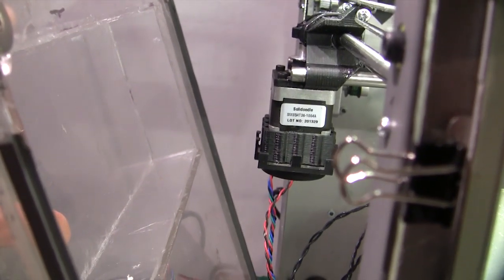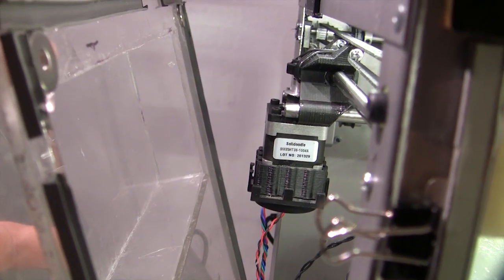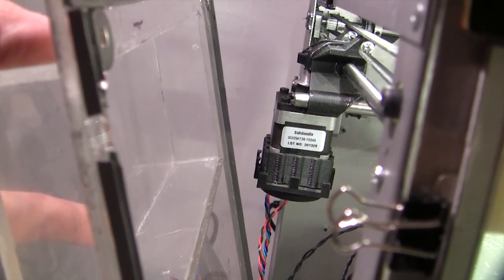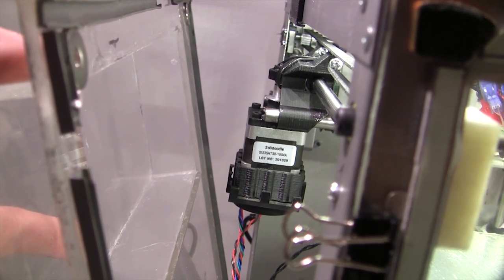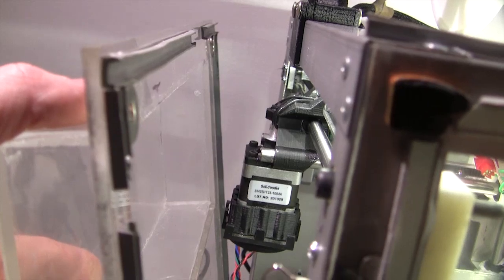And the blob on the bottom is a little fan thing to keep the stepper motor cold, again with a 40mm fan. I have had problems with it rattling loose. It's supposed to be a push fit, but I just put a tiny dab of super glue on it, and now it seems to be holding fine.